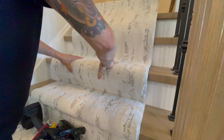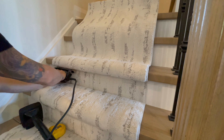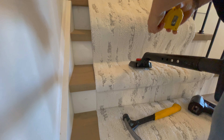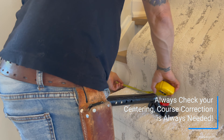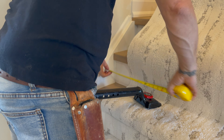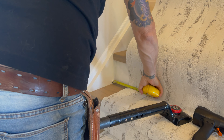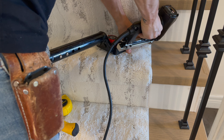Moving on. Preform a little bit. Staple up on the 45-degree angle. Feel underneath — I don't feel anything. Feels good. You don't want any staples popping out in case the kids are playing on the stairs. We've got tension in the middle. Now we're just going to check our measurements. We're a little off on this side — at five and a sixteenth — so we have to straighten that out. We're going to angle this way a little bit because course correction is part of the game. That's why we check measurements all the time. One, two, three. Check the measurement — looking good. Now we'll secure this side: a little tension, split the pile, one, two, three.